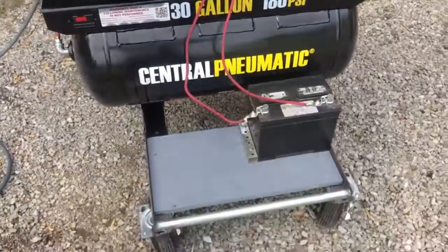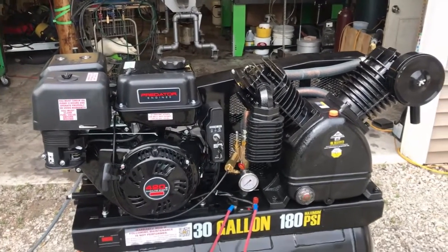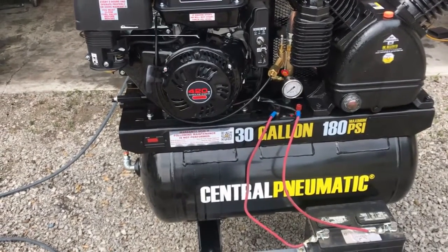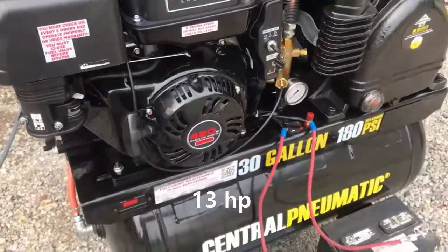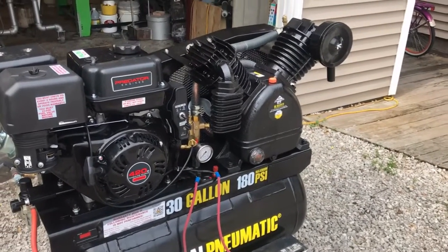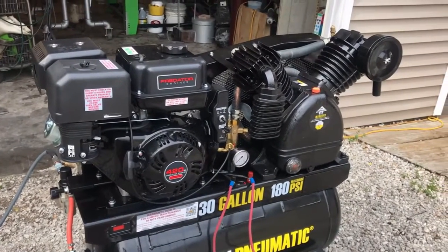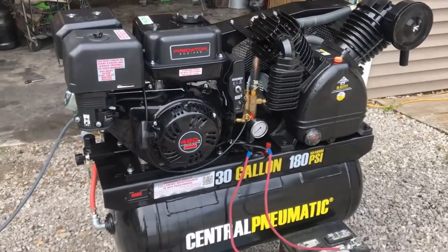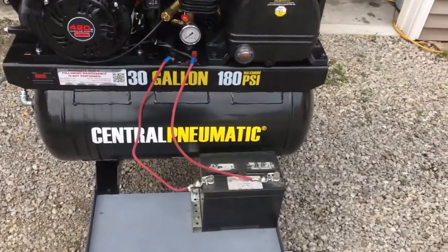What's going on fellas, finally got this air compressor ready to roll. This thing puts out about 18-19 cubic feet per minute around 90 PSI and has a max pressure of 185 PSI. The compressor kicks back on at 140, so when you're running air tools the tools never experience any part of the cycle, which is kind of cool. When you're running nail guns you want that constant 120 pounds, but sometimes you get caught in the cycle charging up from 100 PSI to 125.